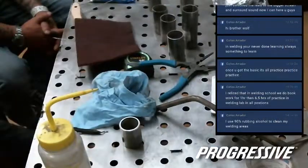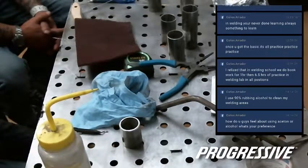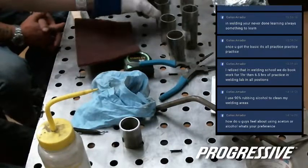And what you were talking about, thinner stuff to thicker stuff, TIG is the machine for welding thicker stuff to thinner stuff. Yeah. Stainless, mild steel, so you could weld the 60 thousandths to 1/8 inch and focus more heat into the thicker part. Right.